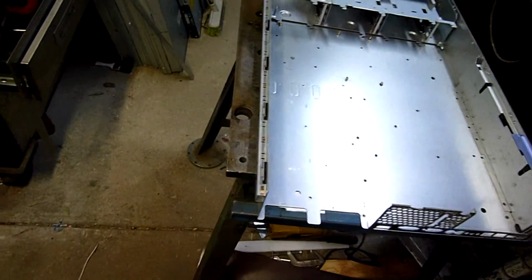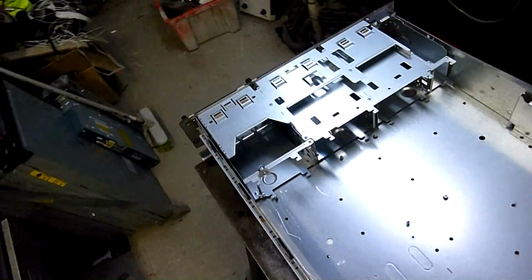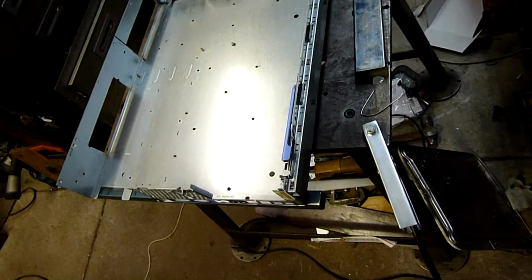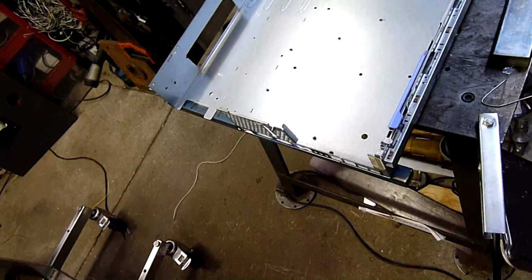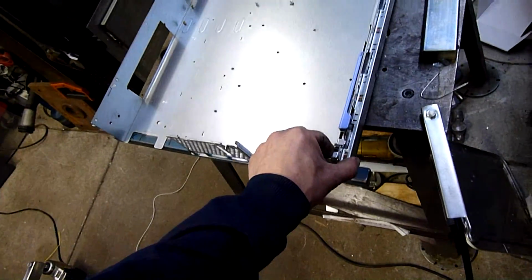Okay, looks good. I've got enough protrusion to sink some bolt holes through here, or screw holes. I'm just going to hold it on the wall with some big coarse thread screws. It's going into 12mm MDF, so that's heaps strong. And once it's all screwed or plug welded to the frame, it'll stop it from doing things like that.